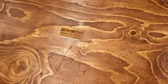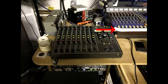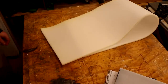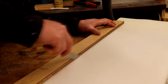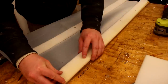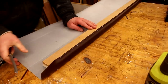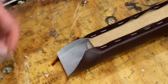I added my maker's marks to the underside of the bottom panel. The final job was to make the wrist rest, which needed to be 50mm wide so that there would be enough space above it on the panel to add masking tape. I ripped a piece of 12mm thick ply to the width I needed — I chose 12mm because later I'm going to be firing in some staples that are 12mm deep. I got this foam off cut and some brown faux leather from my local fabric shop. I cut the foam using the plywood as a template and actually cut two pieces, doubling it up because I didn't think one piece would be thick enough. I first hot glued one piece to the plywood, then added staples all along one side, then added the next piece of foam, cut the faux leather to size, and stapled the other side. For the ends I cut away the corners and folded them in and stapled them, and that looked pretty tidy.